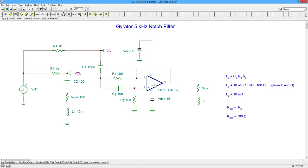And besides, even if you got a big juicy power op amp in here, you would still have an issue with the R value, your R coil. This is one case where the lower limit on the R coil would be insufficient. You'd have to go to a big, massive, preferably air core copper coil for your loudspeaker. Some people would use an iron core, but that does have saturation potential. With the air core, you don't have to worry about it saturating, but there's going to be a lot of copper in there. So sorry to be the bearer of bad news, but there are limitations.